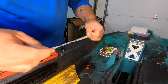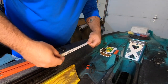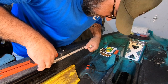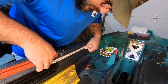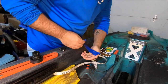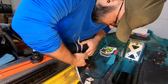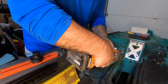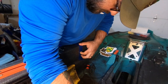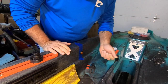When you're figuring out where you're going to put your lights, you want to pick points on the boat that are symmetrical as places to measure from — meaning they exist in the same spots on both sides of the boat. That way you can easily choose positions that will end up looking symmetrical and clean. I chose the end of the plate where the steering rails mount to the inside of the hull. I went about 10 inches from the pedal mount towards the bow and about two and a quarter inches up from the seam in the gunnel. I mask the area with tape, mark the location, then drill to 3/4 inch with a stepping bit. Then I repeat the process seven more times for a total of eight lights.